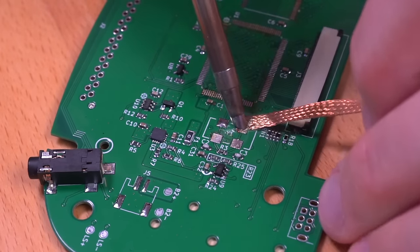Now, all we need to do is prep the rear shell by installing the cartridge shielding. This comes from our donor Game Boy Color and is simply secured with four 4mm M2 screws. Then, drop in the power button cover, which is just the brightness button for the SP. And then, install the rear shell and button everything up. And lastly, press fit the volume dial into the potentiometer. And there you have it — the Frog Boy Color, fully assembled.